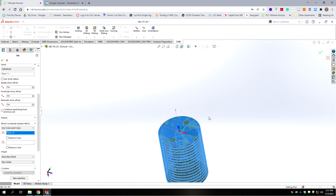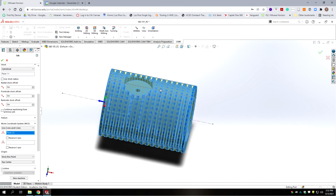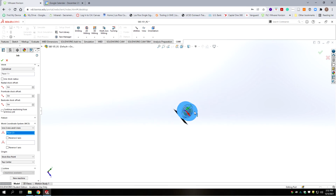On a mill, if you have your fixture set up so it's easy for the operator to get to, you don't want any features behind the part to adjust. So in a fixture for the next op, I would rather have it facing so that X goes what is Z in this axis. So it's somewhat semantics, but that's what I'm going to do.